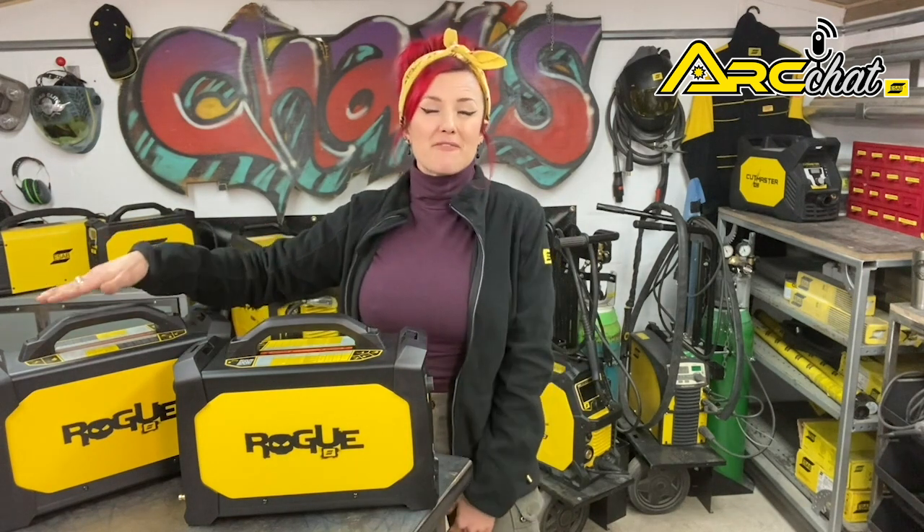As you would expect from a professional TIG welder, these machines have gas pre-flow and post-flow and current ramp at the beginning and end of the weld. One of the features I really love about the 200ip Pro model is the pulsed TIG output, which goes from 0.1 to 500 hertz.